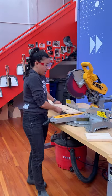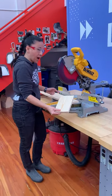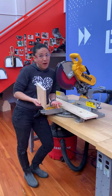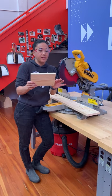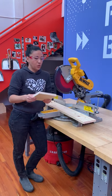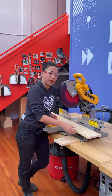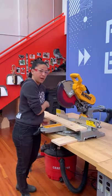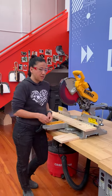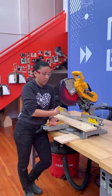Now the answer to the homework question: why couldn't I have measured out all my pieces first and then just cut them one after another? Because if I had done that, I would have lost an eighth of an inch — the kerf — out of each subsequent cut. So it's really important to make one cut, then go back and mark and measure the next piece, then make that cut. Measure, then cut, then measure, then cut. We're going to do that for all the pieces we need on the 1x6.